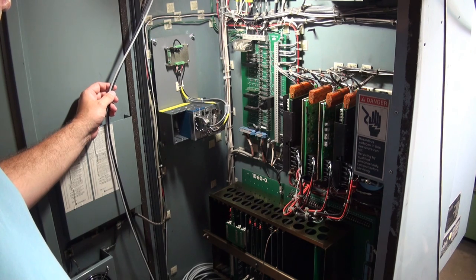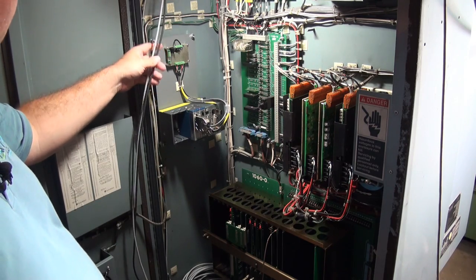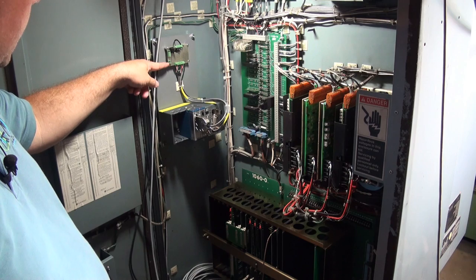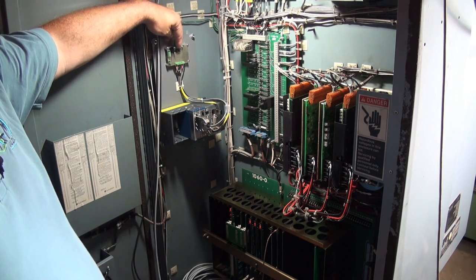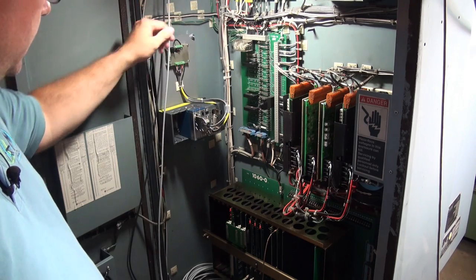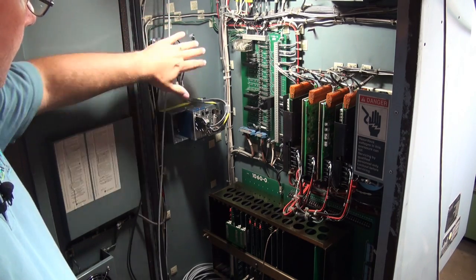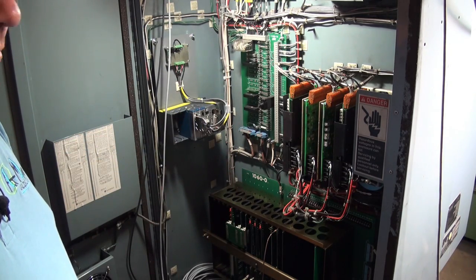So there's our mounting. So now we can start wiring the probe wires into this upper board. So this is the OMM connector, that's the TS27 connector. And then this upper connector here is all the machine interface cables. So now we will start wiring this into the machine, and then that will complete our installation once we have that done.